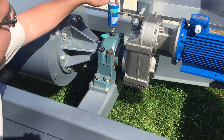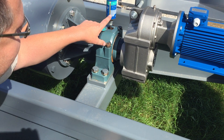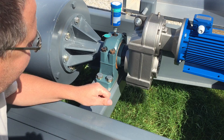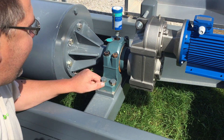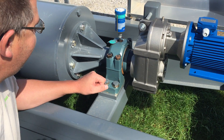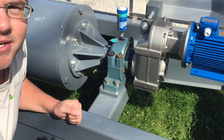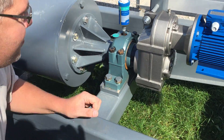For this unit we set it to 12 months, so this entire cartridge will last 12 months dispensing grease into the bearing, and then you simply unscrew it and replace it when it's spent. The bearings are sized for a 40-year life, so if you maintain lubrication this bearing will last 40 years. The seals are not likely to last that long — I would expect them to last 10 or 15 years before they need replacing. The seals hold grease in and keep contaminants out, and you can replace them and get a new cartridge to do that.